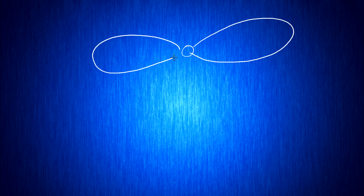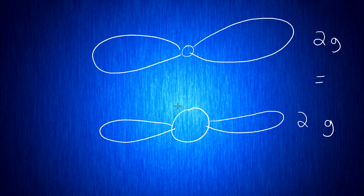For a bit of background: you intuitively understand that a heavier object accelerates more slowly than a lighter one. The moment of inertia has to do with the rotational acceleration of an object. Two objects that weigh the same can have different rotational acceleration — for example, a prop with a tiny hub and big blades versus a prop with a big hub and tiny blades. Even if they weigh the same, the prop with more weight in the blades will accelerate more slowly.